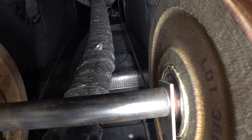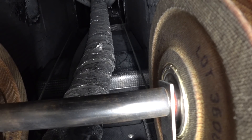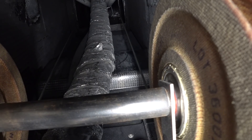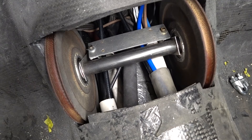This is the other side — that's when it's slacking off, in other words pulling the other way, and this is when it's pulling on it. That one doesn't seem to be moving really much at all, so I'm happy with that one. Looking up the back here, with the amount of tension I have on it now, which is just over 100 pounds, there's little to no movement back here because the tension has just taken up any slack that was in the system.